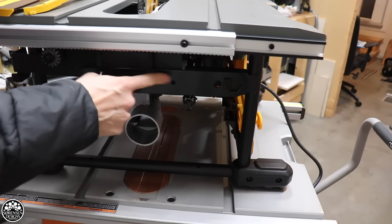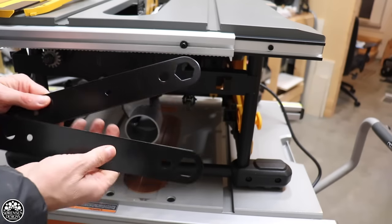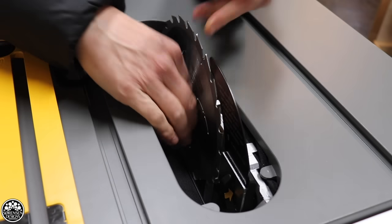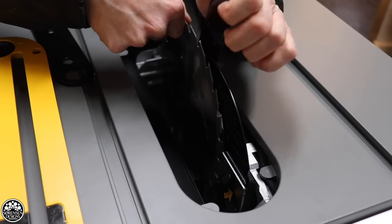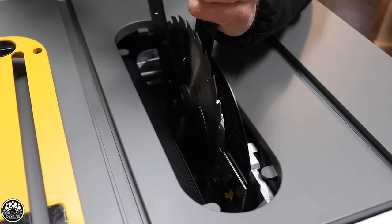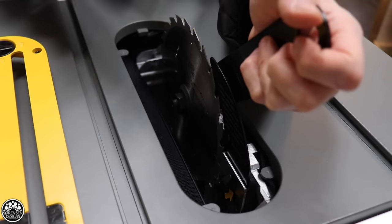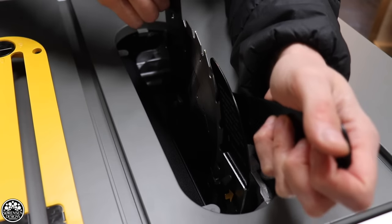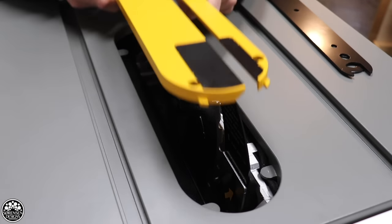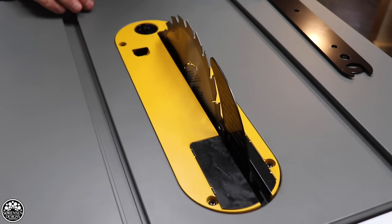At the back of the table saw we have the wrenches, held on by a wing nut. We've got two identical wrenches. We want to make sure that the blade is on nice and tight — it's already been pre-installed. Using my finger I can tell the nut is on there tight, but I'm just going to double check. You do not want to over tighten these. I'm going to use the open end on the inside and the closed end on the outside. That's it — tightened and confirmed. Then put the throat plate back and lock it in place.